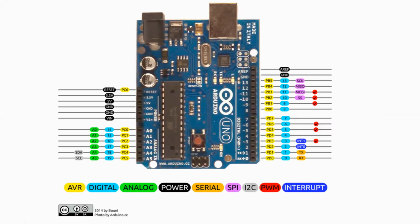An Arduino has about 14 input-output pins, but actually pin number 0 and number 1 are kind of dedicated for transmitting or receiving data, like from a serial monitor. So you don't want to use those two within your project. You want to leave those two free for communication. So that boils down from 14 pins, you only have 12 to do what you have to do, all right?